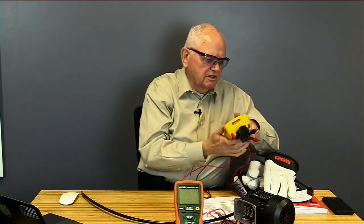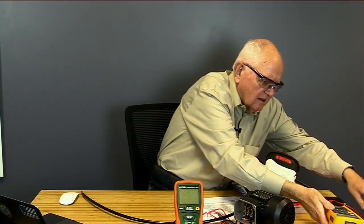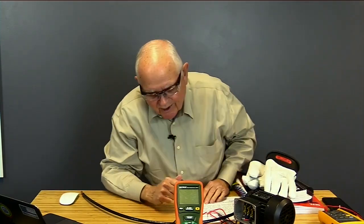if I built a hydraulic system. Let's say that I am a great hydraulics engineer. Not, okay? But anyway, I build this hydraulic system. I've got valves and pumps and, of course, lots of piping, accumulators and all these kinds of things. And I'm going to energize that hydraulic system to 1,500 psi. Being a smart guy, I'm going to test that system to make sure there aren't any leaks in it, or somebody could get hurt at 1,500 psi. So I hook up some test fittings to the piping, go to a little pump, and charge up my hydraulic system to 25 psi. I didn't get any leaks.